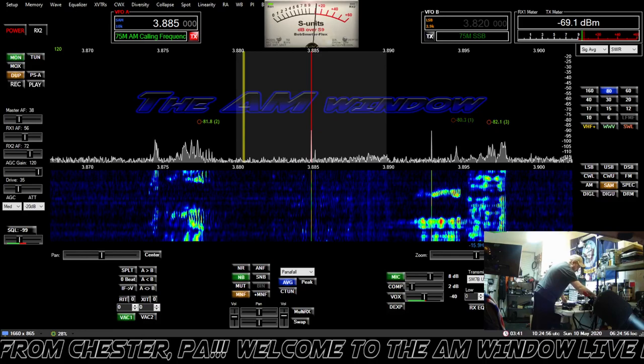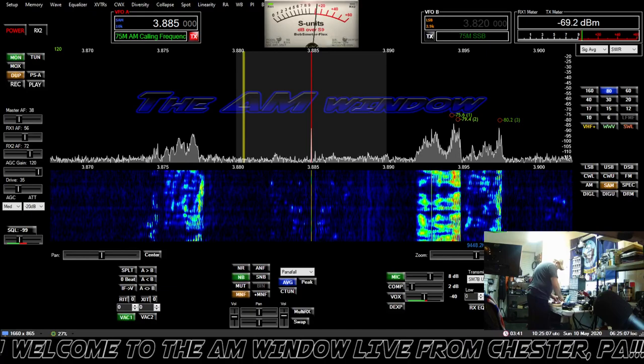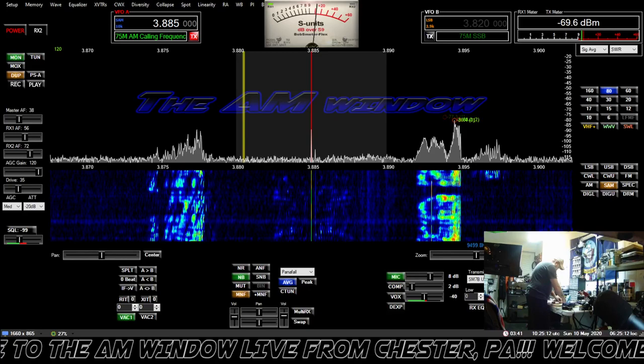But when he's running from the LMR to that LMR 400, that's about 150 feet, and I get an SWR of about 1.2, 1.3, so that's not too bad. Not too much of a loss there.